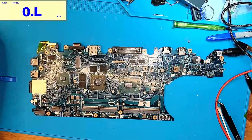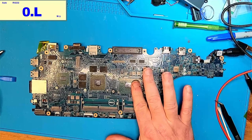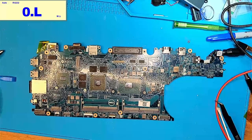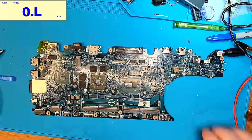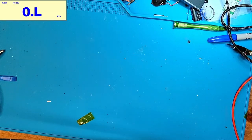So I wonder if it'll boot with only, first of all, I'm fairly certain the CPU is destroyed because it had 19 volts going directly to the CPU, it seems. So I wonder if it'll boot with just the one MOSFET. If the CPU is still good, will it boot with the one MOSFET? I think we should give it a try and see. I don't think I'm gonna be that lucky though. I think the CPU is a goner. But I'll still order another one of those chips and replace it just to be on the safe side.